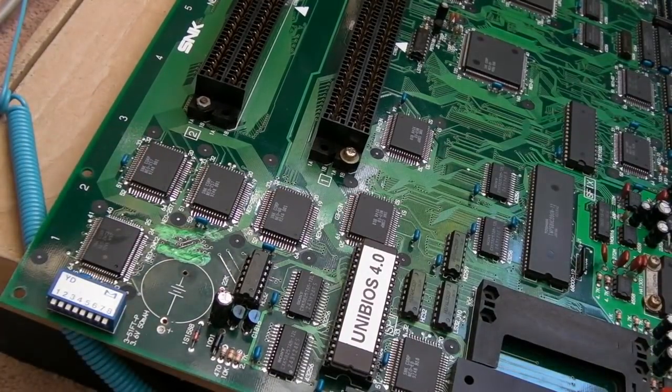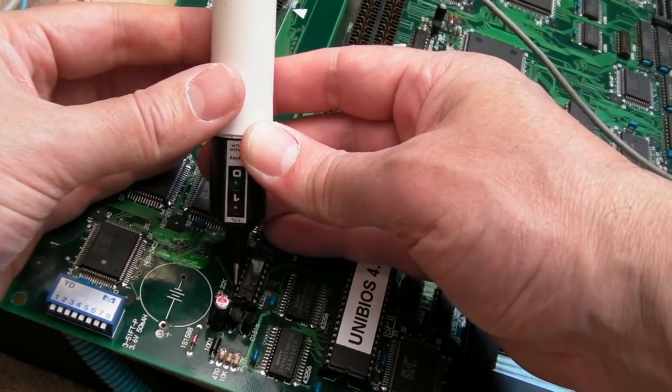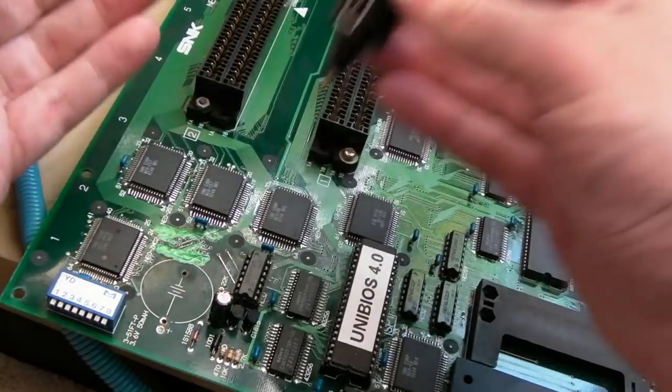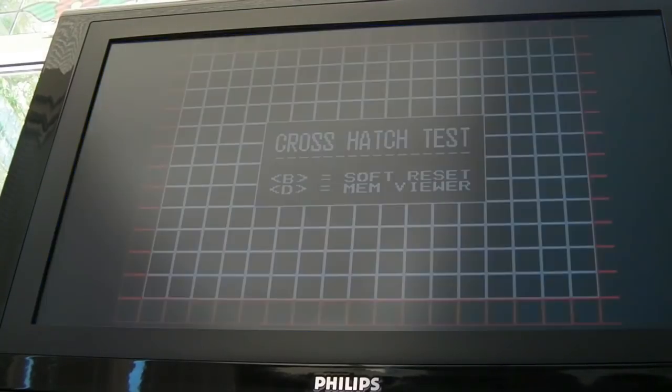Let's just logic probe that and see what that says. Got a high and a high. It was a high. Oh, it's all right now. Now it's all right. Oh, that's just really annoying. As you can see there, I'm thinking it's that HC32. I don't think it's the actual connectivity there. I actually think that HC32 has got a bit of a bodgy gate on it or something, because it's strange, isn't it, our probing it.